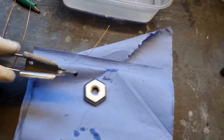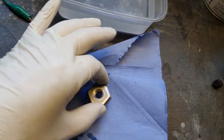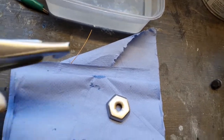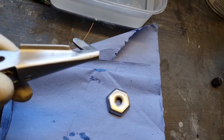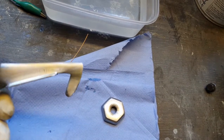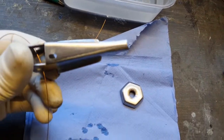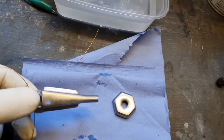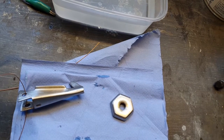The next bit is coming onto plating itself, so you're going to need some gloves. These are the two parts we're going to try — they've both been sanded to 400 grit, and you can see we've got rid of a lot of the pitting. It's not perfect, but I think this is a good test. Nickel won't fill in gaps, so if you've got a pitted surface it will show through — same with bodywork. Your parts are going to come out as well as your prep.